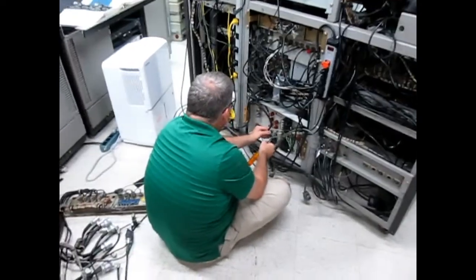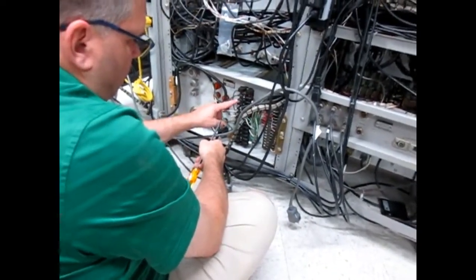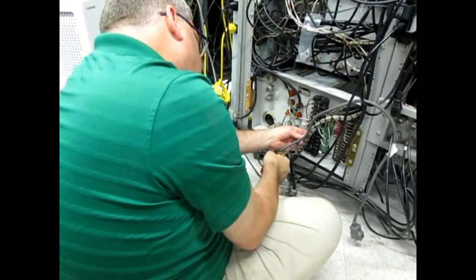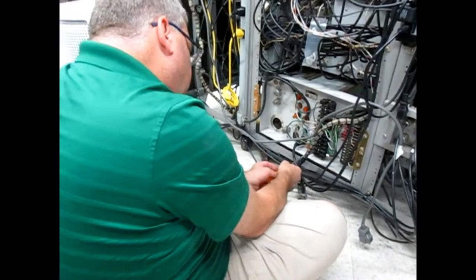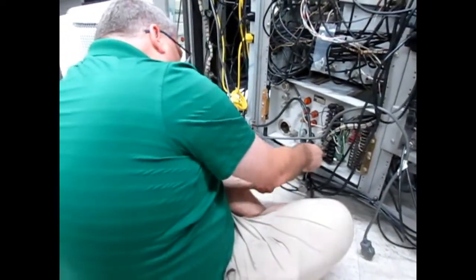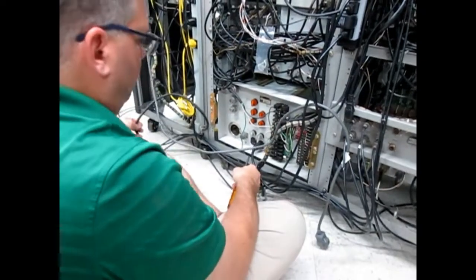That power strip there. That big barrier terminal that you're unscrewing, yeah. That thing works in threes. Groups of three. You see that first group there with the black wires? That's the lines. The next group with all the white wires, that's the neutrals, and down below that is the greens, or the grounds, the chassis earth grounds. That's basically all it is. If you can think three and count to five, you don't even need to worry about labeling wires, as long as you can see black, white, and green. So that's one. That's AC to the power strips.